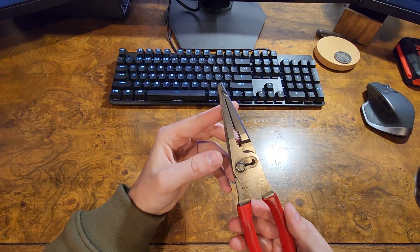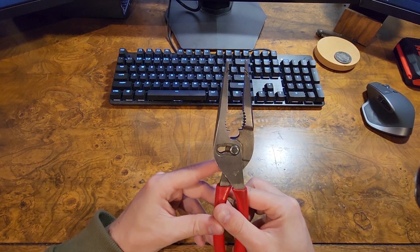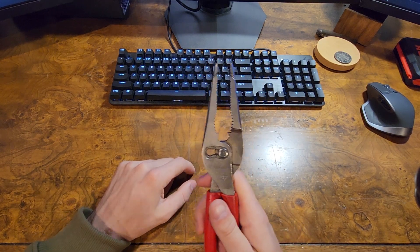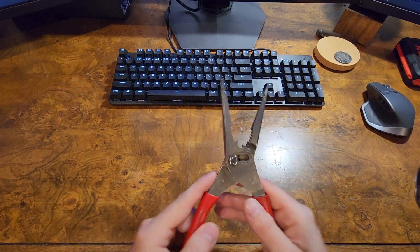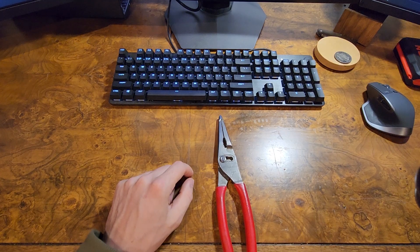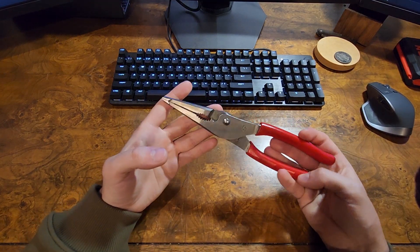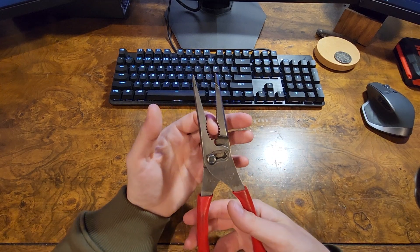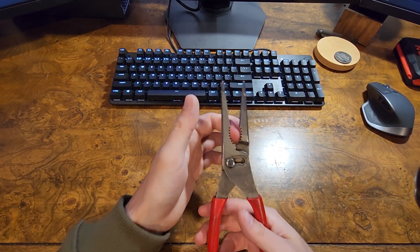There's a few things I don't like. Starting off with some of the basic features, you've got the main reason for buying them - this triple adjustment joint. Surprisingly handy actually. I find if I'm using the space in the middle here to try to get on a nut, or usually a pipe fitting of some sort, these jaws grip okay. They could definitely see some improvements, especially when you compare them to the Knipex Cobras - the seven and a quarter inch or the 10 inch variety - these don't really grip as well. So if you've got rusty old pipe fittings or anything with even moderately snug access, the tips on these get in the way quite a bit. But for here and there grabbing stuff, these center jaws are pretty nice.